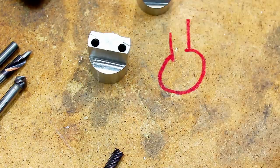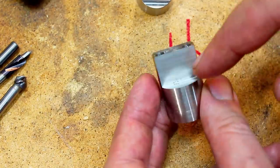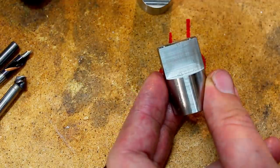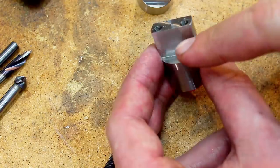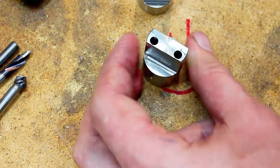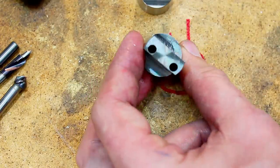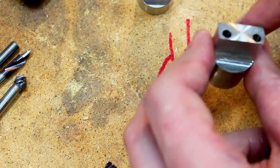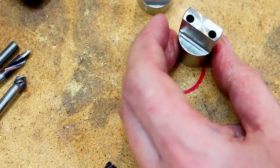So to increase the speed on this process, I'm taking an inexpensive carbide end mill. Oops. Well, that's a chipped cheap carbide end mill now. And I hog off most material just with the part in this orientation. When I'm already here drilling the holes, I can also machine on those two surfaces. And I need to do some milling on it anyway in this orientation because I'm doing these as a batch. I'm doing all of them like this.